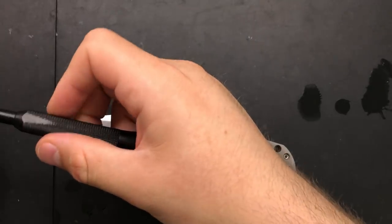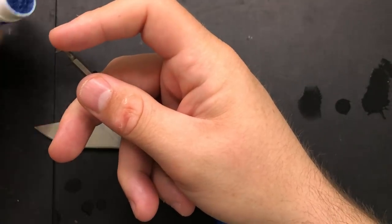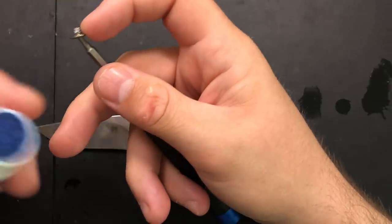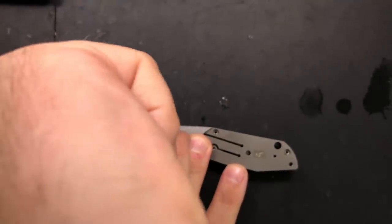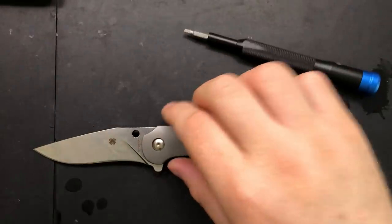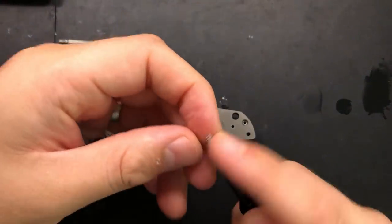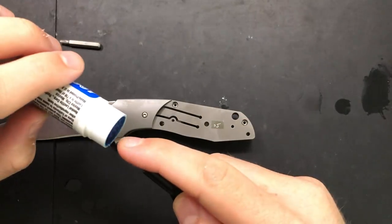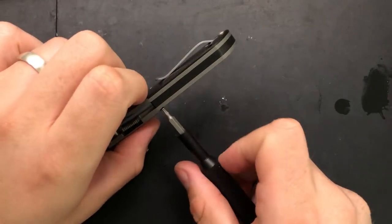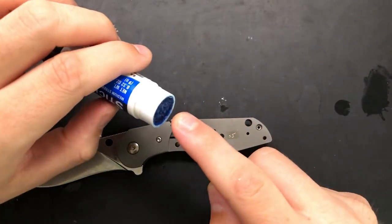What I'm gonna do is go ahead and use a little bit of threadlocker on the pivot here — a little bit of blue threadlocker on a stick. Take a look at my knife disassembly toolkit video to get more details on what tools I'm using here and why. I kind of backed the screw out a little bit there. You want to make sure you don't over-tighten initially — don't crank it down too hard, or you run the risk, particularly on the older bearing system Spydies, of pinching something in there.